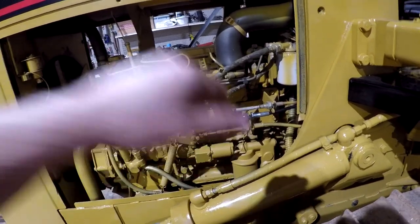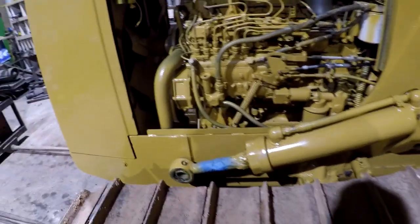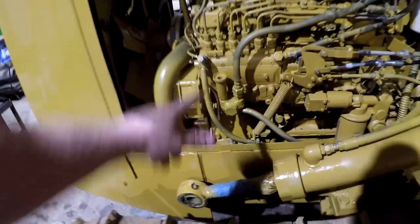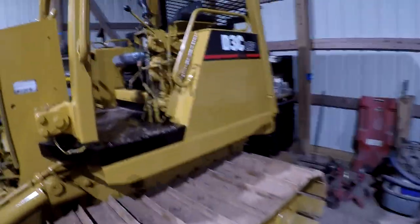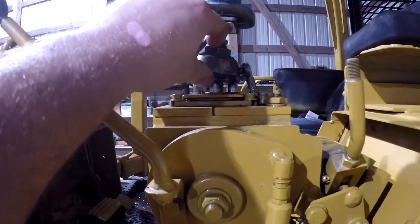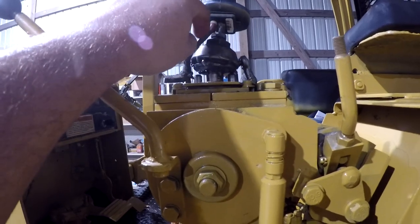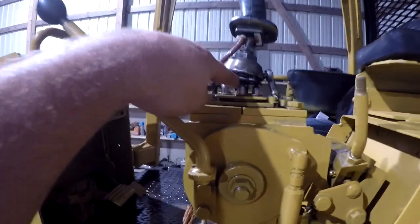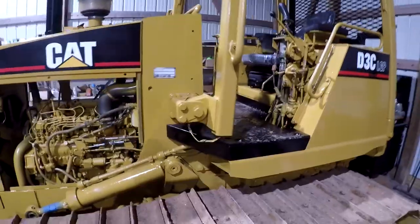I've got a new cable put on here that goes to the hydraulic pump down there — it controls the pressure and keeps you from loading the engine down too much. The other one was messed up; it had a spot rubbed through it and was binding up. I've also got a new primer because this one's all frozen up inside — I couldn't get it to work when I put it back together. I ordered a new swivel for the joystick, this whole little piece right here, and it was about $150. I thought I ordered a seal kit but I ordered the wrong one, and these parts are non-returnable, so I'll have to order the correct part. You can see there's fluid coming out of there around that, so that's something for another video.